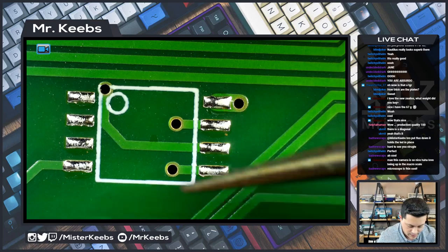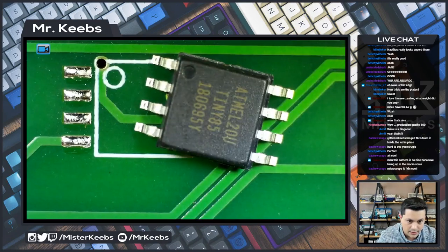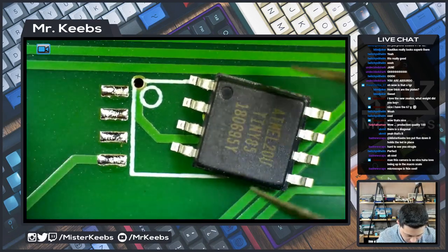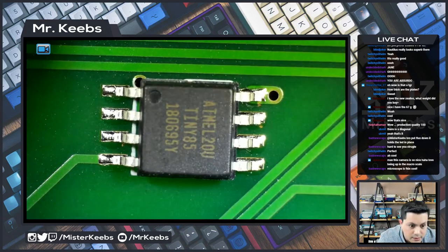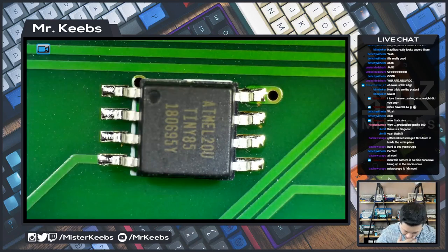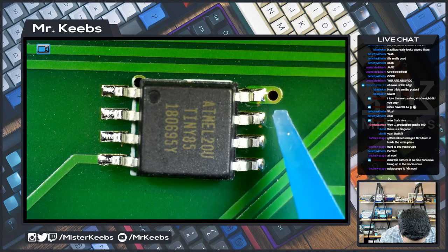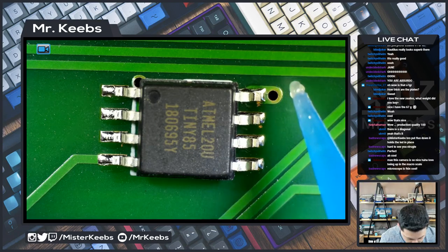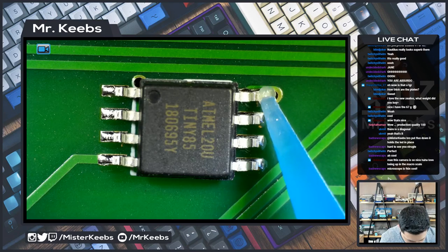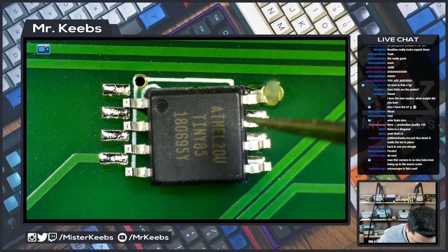So can you guys see that we have a little circle here? So the idea is that we align the circle on the chip with that circle right there. So let's see, right there seems to be good. Let me add flux to the top left or top right pin. Like that, and I did move the chip. That's what I didn't want to do.